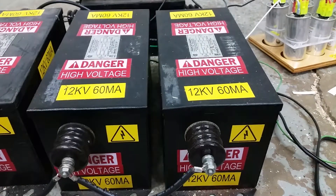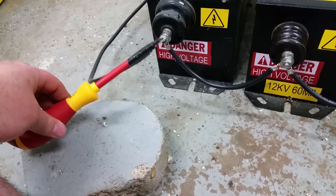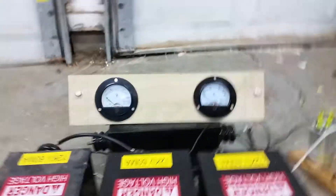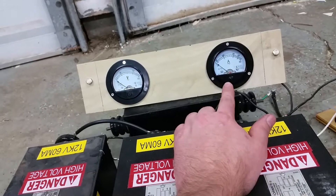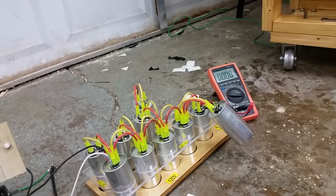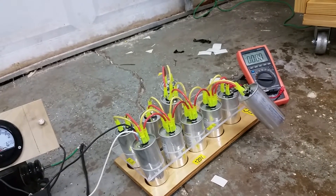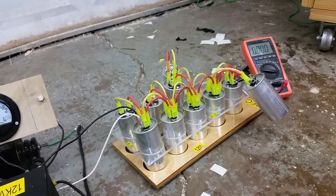Here's what I got so far. I'm using my insulated screwdriver to draw an arc off this terminal. These three are phased together. I've only got the current gauge working right now — that's where I'm watching my current. I'm using my multimeter to watch the voltage off of these. I want to make sure they weren't retaining voltage or taking a long time to bleed off, but they've evidently got internal resistors that shunt them off, so it dies right away and they don't get hot.